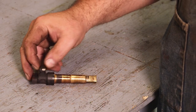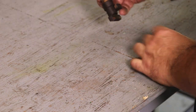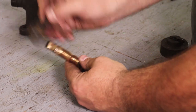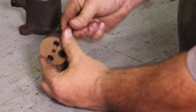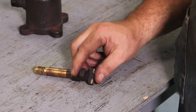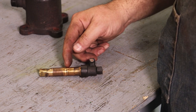The next thing we've got here is we've got to do some TLC to this stem — this is the valve stem for that brake valve. This comes up through the housing; you've got the housing here, this stem comes up through and goes through that bushing, and you've got the square piece at the top that the handle fits on to actuate this thing. This down here fits on top of the little valve gear in the bottom, turning it and opening and closing the certain ports — one's a pass-through and one actually turns the brake on. As you can see, this piece has issues. It is significantly worn down right in this area where we have now put the bushing in to replace that.